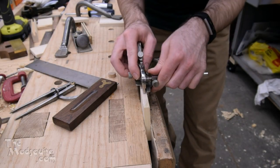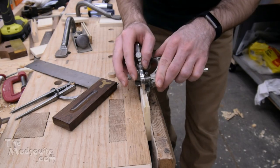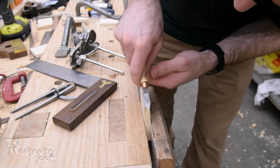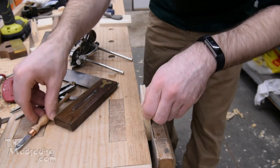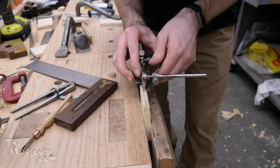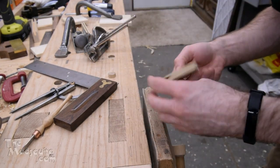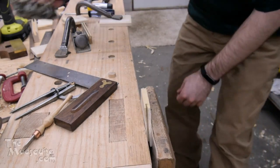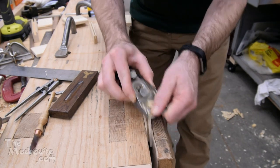Now this could have gone a little bit better. I probably should have done this at the beginning and just knocked out that corner with the marking knife first. But it's not something that really matters as far as the width goes, so I can just plow this groove through the end with this plow plane and then clean it up with that block plane again. And now I'm just going to grab that Fulton block plane and shave down the front — what will become the front — to get rid of that blowout from the plow plane.